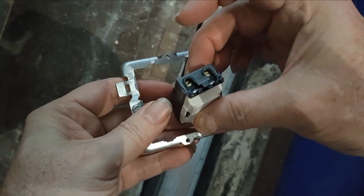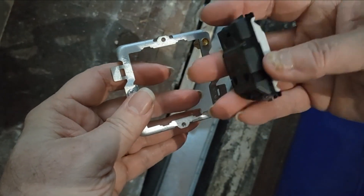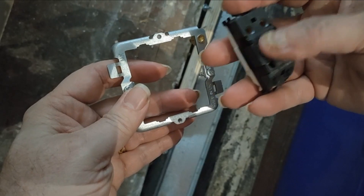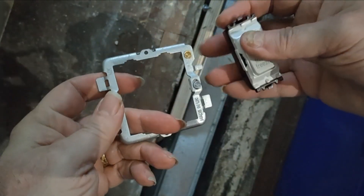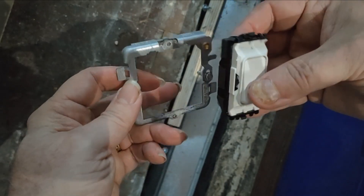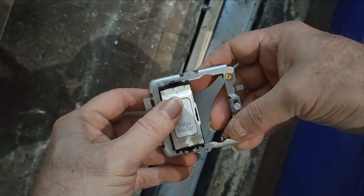Before you can fit the module into here, there's where the screws are and this plate interferes with those screws. The best way I can see is to get this fitted up like a normal fuse spur - you've got your supply and your load. This isn't earthed so you've got to get your earth in - there's an earth there and an earth on the back box. Get your cables in first, get them screwed in, and then it clips from the front to the back.